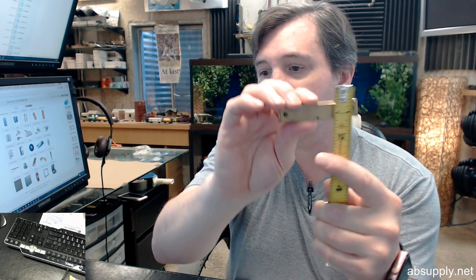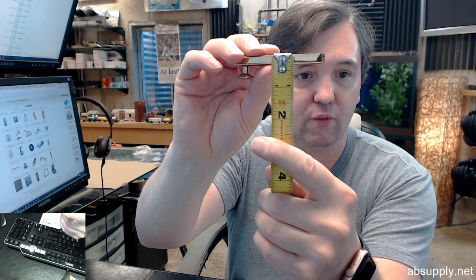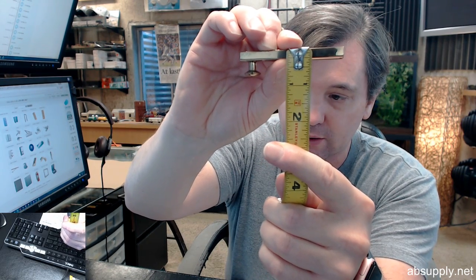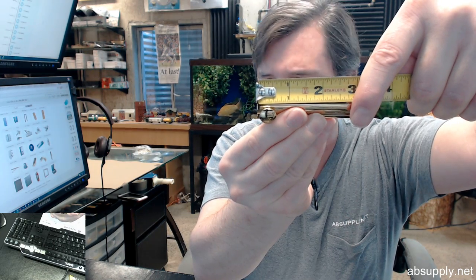There is a link below this video to a document called Template that will give you the important dimensional properties of the item, and let's go over that now. Overall length, that's where your 3-inch comes in. You've got a body width, they don't give that, but it's about 5/8. You've got an overall projection of about 5/16. We're giving it at 0.28. Yeah, right there. Okay. Dimension of 5/8 of an inch roughly in terms of the overall height of the bolt when you consider the knob itself, which is a 1/2 inch off the end to the center. That's a little bit off. It's closer to 3/8, I would say.